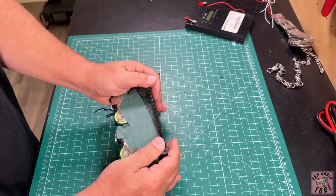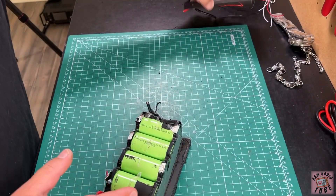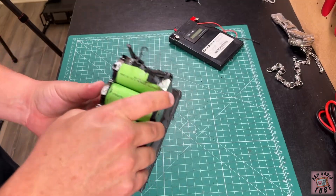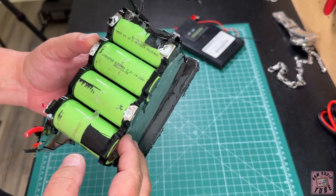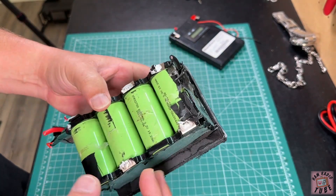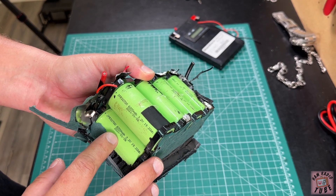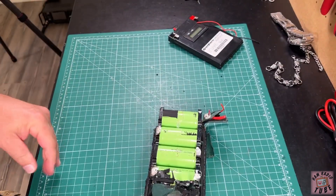It's proving quite difficult to completely dissect this, but what we're seeing is an overall pretty good construction. I wish the soldering was a little better, but I'm kind of nitpicking. The cells they're using are 32700, 6,000 milliamp hour. We've got four in series and two in parallel — four cells make one 6 amp-hour battery, and two pairs of four in parallel doubles the amp hours without doubling the voltage. They all appear to be from January 6th, 2021, so they're all the same lot. I'm going to guess just the BMS failed — which is unfortunate, but this is a very solid build.